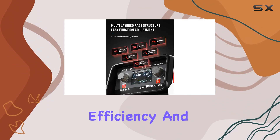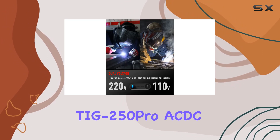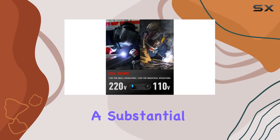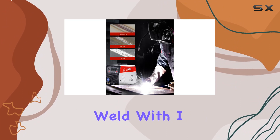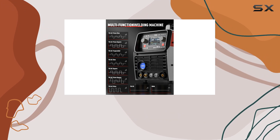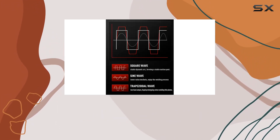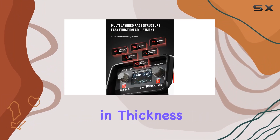The amazing efficiency and reliability of the multiple IGBT inverters in the Andeli TIG 250 Pro AC-DC contribute to a substantial increase in duty cycle, making it a joy to weld with. I was able to effortlessly weld a 0.04-inch seamless aluminum plate using cold-spot welding and tackle stainless steel plates ranging from 0.015 to 0.12 inches in thickness.